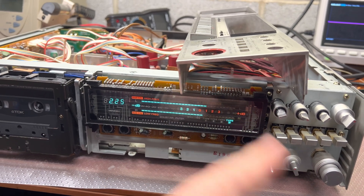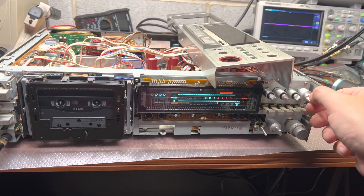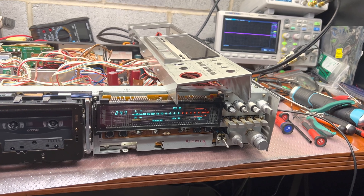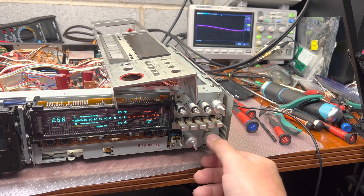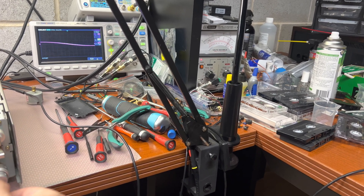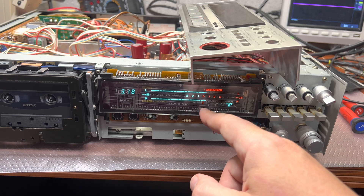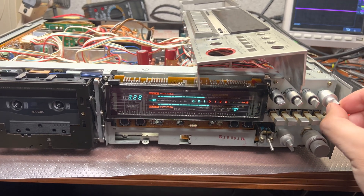Good, the calibrator is correct. Levels are off — one more time, change bias, levels change. At 400 Hz source is over, tape levels are too high. Adjusting until source and tape are even — levels even now. Bias even and at zero at this moment. Good.